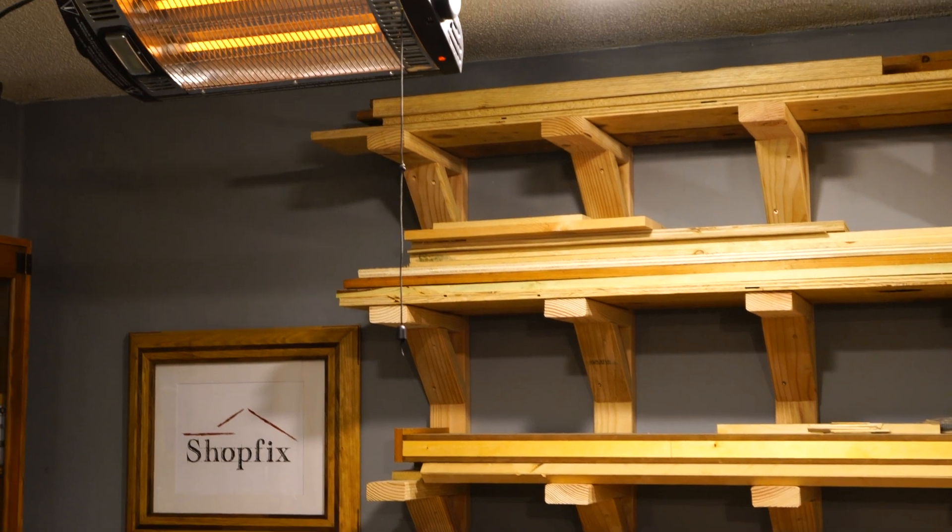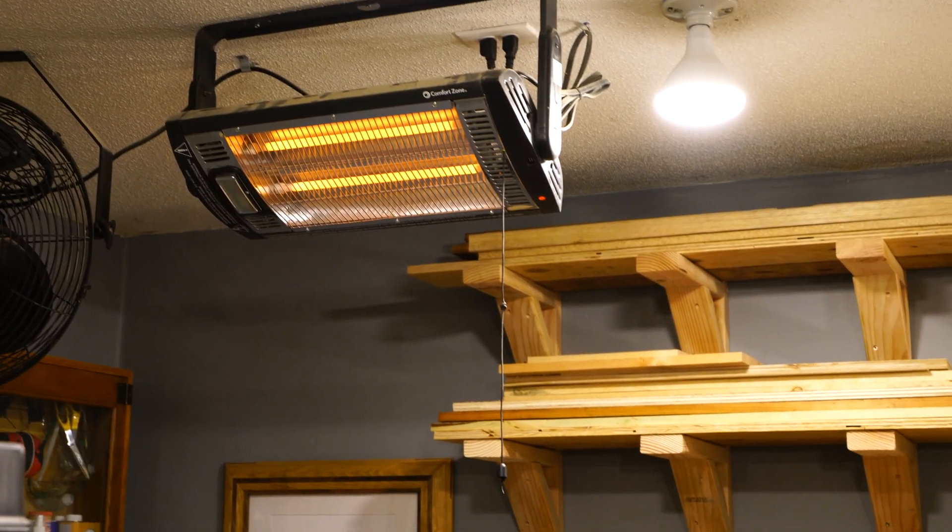The third line comes in for anything you're using in addition to dust collection and a machine. In my woodshop, I often have an infrared heating unit going at the same time, and that has to be on its own dedicated line — not just a dedicated outlet, because all those outlets might be running off the same electrical line. So once you figure out what machines you want to use, you'll need to weigh whether your space is already heated, whether you need a heating unit that draws electricity, and whether you want a central dust collection system or a shop vac — to determine how much electrical you need.